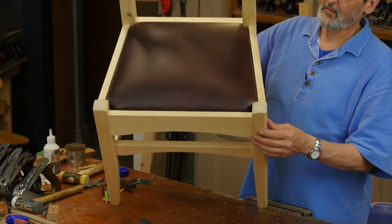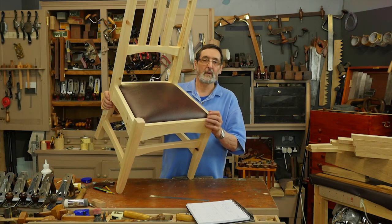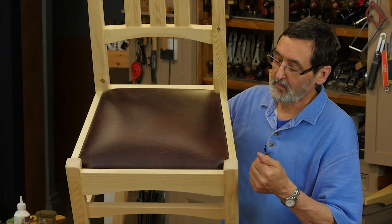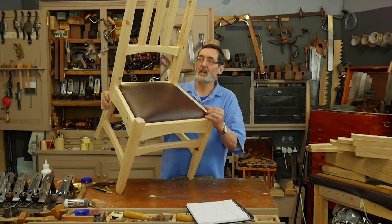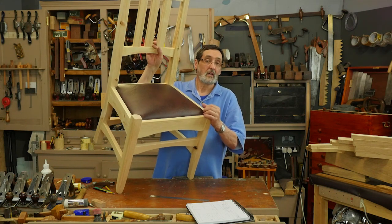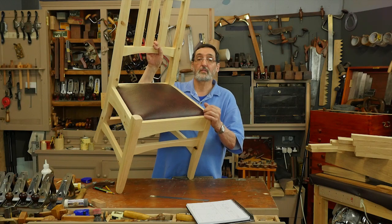Can you see how the chair is narrower at the back than the front? This is the essence of a good chair. If it's square it will look like it was made for a school or council office. A good chair always tapers from wide at the front to narrow at the back. Arching here, no backbone problems, a slight curve on the back rest, plenty of support — those are the features that make a good chair. So let's get on with the layout and I'll show you where we're going from there.